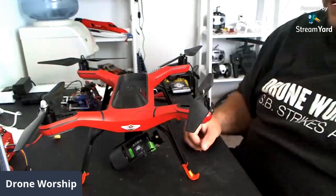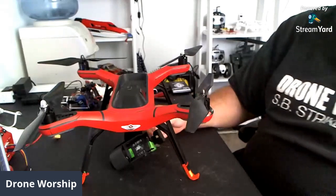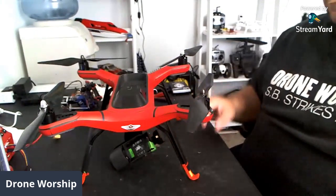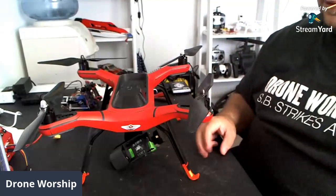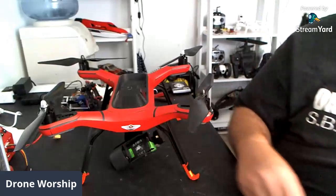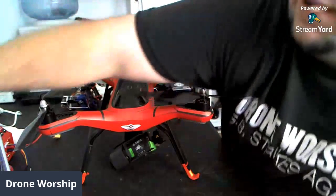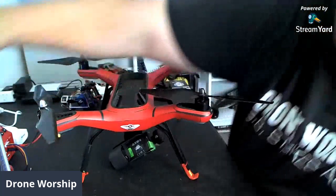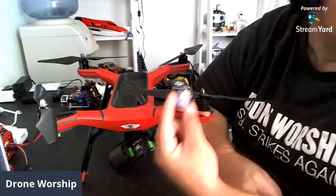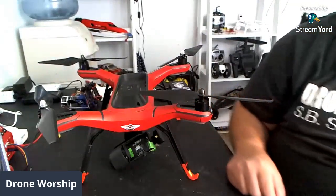The stock gimbal is basically built out of a lot of aluminum and it's very heavy — it has massive motors on it. I have a feeling this is actually taking away quite a bit of flight time. So we're going to pull all of this down today, redo a bunch of the flight parameters, and do a little soldering. We're taking the whole top of the Solo off. We're going to solder in pin 14 again. I was going to use the breakout board, but I decided against the Brownie Board's breakout board because there's some other stuff I want to do. I want to have the relays open and available for that pin outsourcing, so we're going to be doing a direct wire connect.